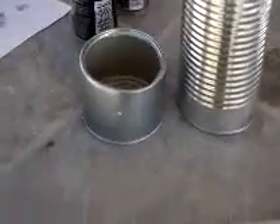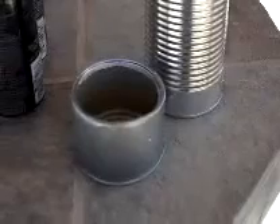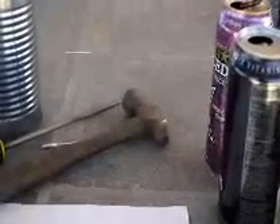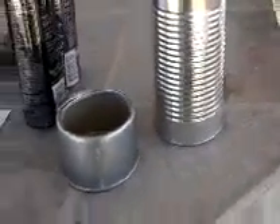We've taken the bottom out of the small can and the top out of the big can so that the two cans will set together and form a nice bond — that's kind of the final configuration, although they'll have some other pieces. We added a round file to remove any burrs, used the utility knife to cut the small tin, and we'll use the ball peen hammer a little later. You want to remove the paper off of the tin cans and as much of the glue as possible. Any glue will melt when it gets hot and become a sticky mess, staining the can black, so try to remove that if you can.